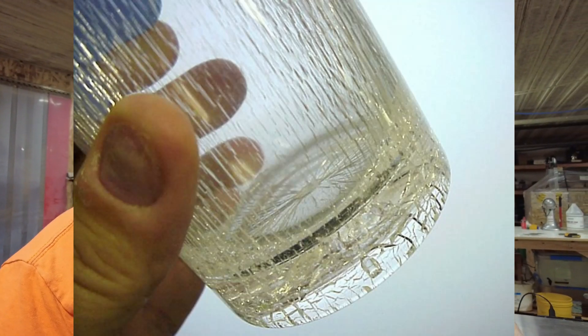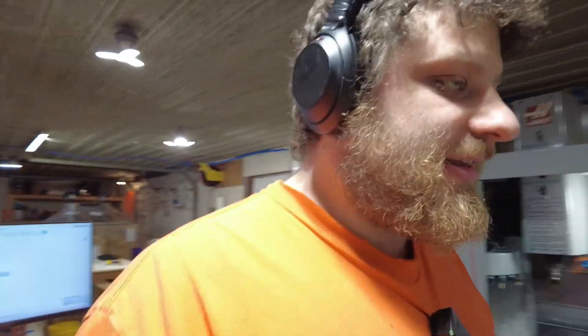But there's one more thing I forgot to mention: crazing. Crazing is chemical damage caused to acrylic — it looks like micro-cracking throughout the material. It can be caused by thermal stresses, which is why I run with coolant, use a lower surface speed, and a higher feed per tooth to keep the cut cooler. It can also be caused by chemicals — specifically alcohol wipes will destroy your part. The worst part is it might not be immediate, so you could ship a perfectly good part and it arrives to your customer all cracked and crumbled.